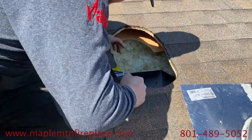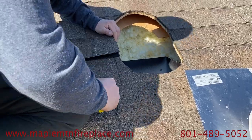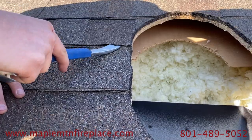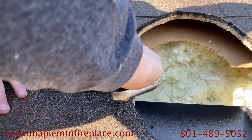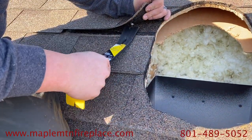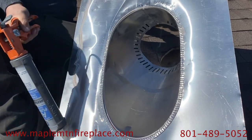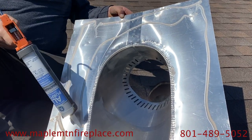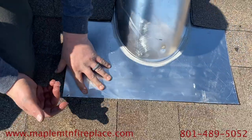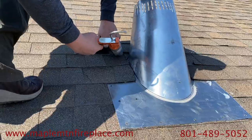Back to the roof flashing — we're just prying up the shingles around it and removing any nails that would get in our way of sliding this flashing right underneath the roof. Typically we go about halfway; here we're probably two thirds of the way, so this is a good flashing. We add a little silicone underneath just to make sure — it's not really required — and slide it back under. Make sure it's nice and flat on the bottom, and we just attach little drywall screws and then silicone those.